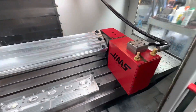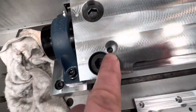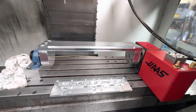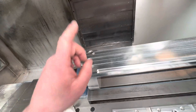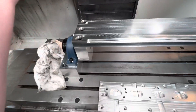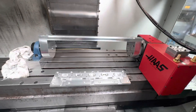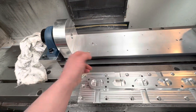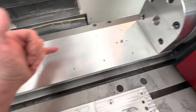We've got our three M16 low-head cap heads in there. I drilled, counterbored, and knocked in some 8mm dowel pins whilst it was aligned. I rotated it 180 degrees so it was true to Z, then came in, pocketed it, spotted it, drilled it — using only a drill so it was a tight fit for the pins — and knocked them in with a punch. It will come off, but it will ensure alignment because we want this trunnion table to always be in alignment with these pins.